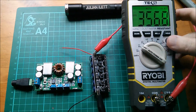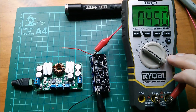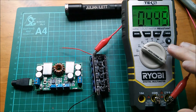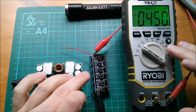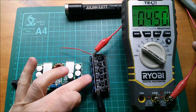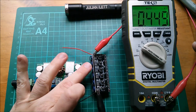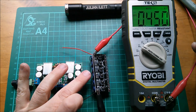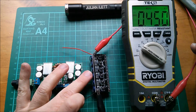I wouldn't expect to see too much voltage... oh, there's actually half a volt on there. That's more than you normally get — you normally get a few millivolts. So yeah, half a volt on that. That's amazing. Why is there half a volt on there? Why hasn't that discharged? This has been sent through the post from China, and capacitors normally have quite a significant self-discharge rate. I'm quite surprised at that.